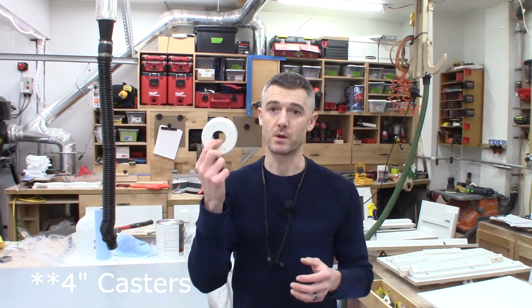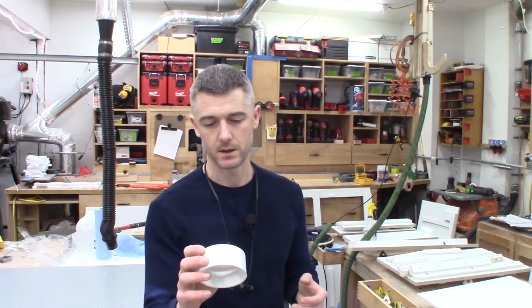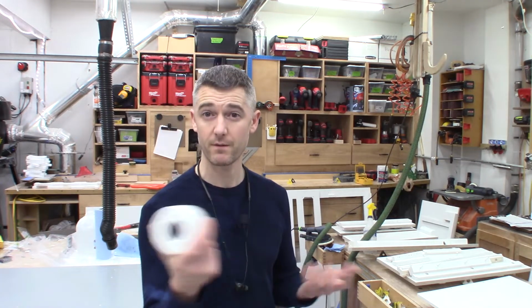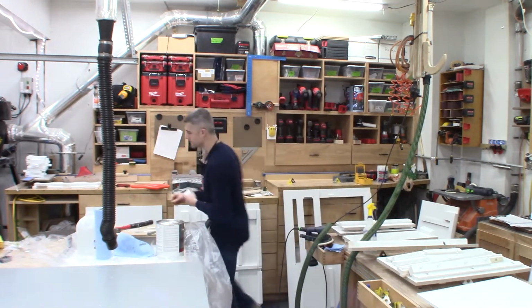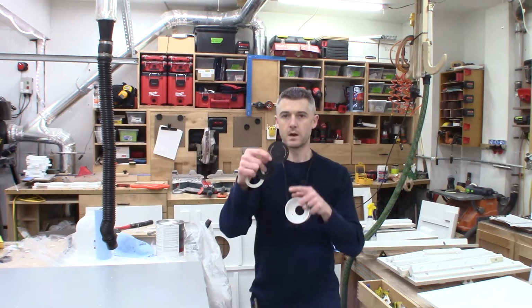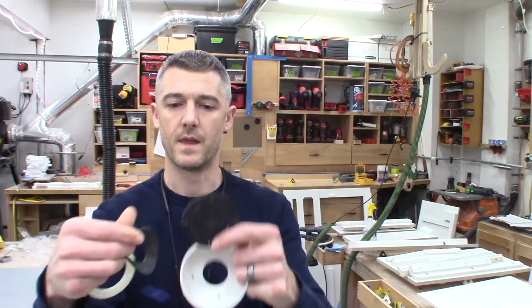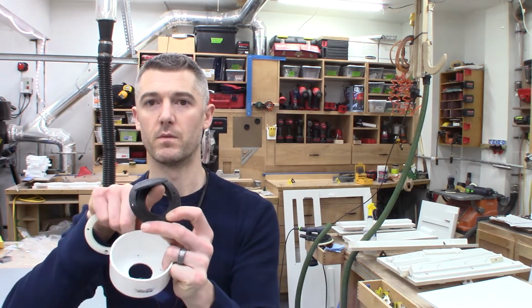Last thing is what I'm holding in my hand here. This is going to be a check valve, essentially. Some of the instructions on the PTS form are to use what's called a scupper valve for boats. Essentially, it's a valve that blocks water from going one way but allows it out the other. It's rubber. It's got some flat pieces to it. I can show you here. Should have had that in my hand as well. But here's the flap. And then here's the gasket that flap butts up against. So it won't allow airflow to go this way, but it will allow airflow to go this way.